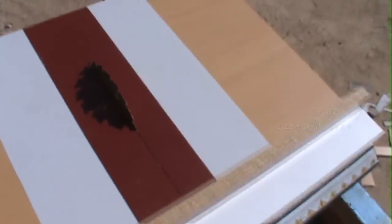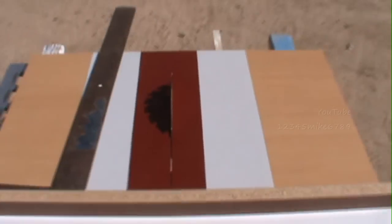Alright, it's starting to look like a table saw sled. Yeah, I'm going to add a big piece back here, tall, to hold the verticals, and probably have it 3 inches. That way I can have a full cut across this distance. I think it's like 16 inches.